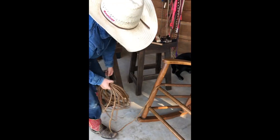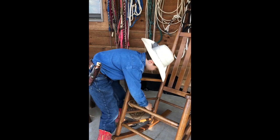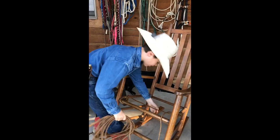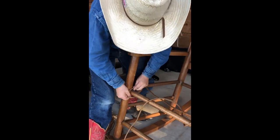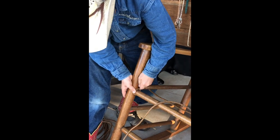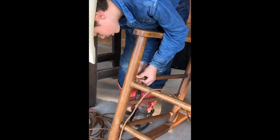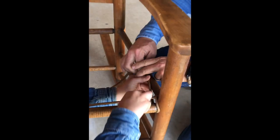Now when you get that stapled, you'll take your coil and go over the front rail, up to the middle, over the left rail, up to the middle, over the right rail, up to the middle, and back over the front rail, up to the middle, and set your coil down. Now you need to come back and tighten these — pull real tight and hold your thumb to keep the tension on it. Tighten over here and tighten over there, just working these corners.